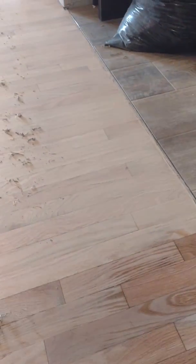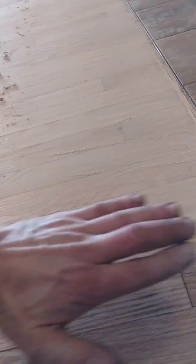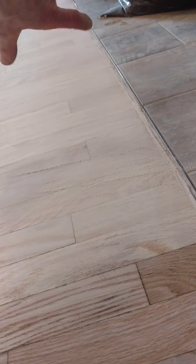The idea of water popping is to make the grain — or the wood — all have the same texture. So I'm doing a little test area here without hand sanding this area, to see what it looks like. What I usually do is hand sand the butt ends about eight inches out, right where the edger runs.